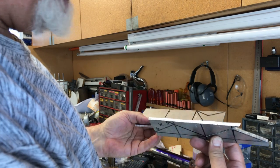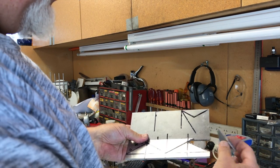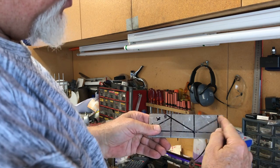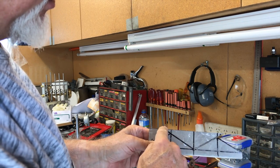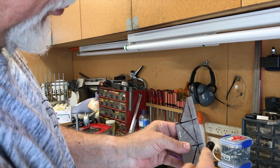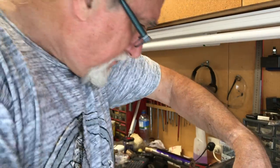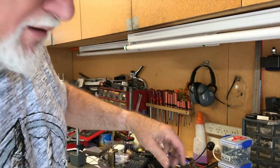So I started off with this piece of quarter-inch, or five millimeter thick, aluminum scrap and I just cut this piece out of it. I'm going to be cutting along this line to here and this line to there - that'll make one triangular piece. Then if I cut down to here and across these two lines, I'll have a triangle here, a triangle there, and a triangle here - so three triangles to put on the chuck.